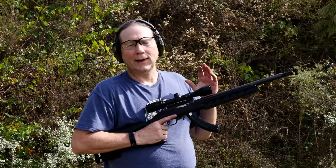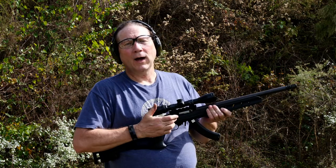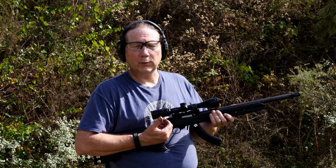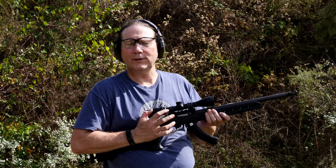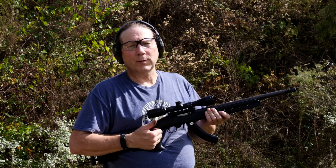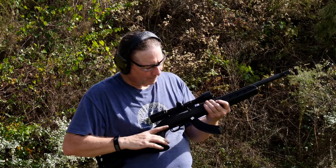Okay, so we're back, and this is going to be, I think, pretty much the final round. I've got the extractor in, and I have replaced the recoil spring with another factory Ruger recoil spring, because like I said, this gun was manufactured in 1978, seen a lot of use. So we're going to go ahead and run through some of the polished mags, and lastly an OEM, and see how this thing works.